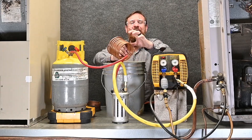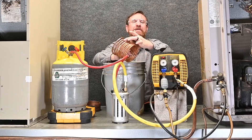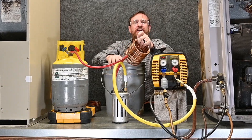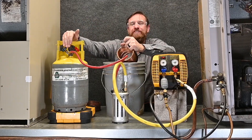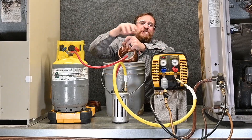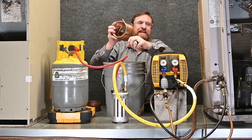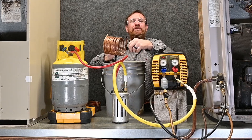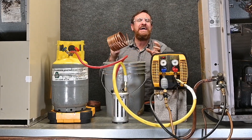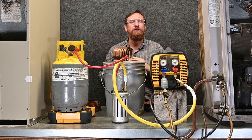The downside to using the sub-cooling coil is that once you're done, you have a significant amount of liquid refrigerant remaining in the connections and hoses. So I add an extra valve so that when I'm done, I can put this on my recovery machine and recover that last little bit out. It sounds like a lot of steps, but I simply want to recover all the liquid refrigerant in there, it doesn't take very long, and we can let that happen while doing the rest of our work.